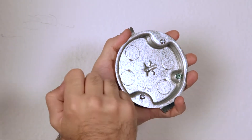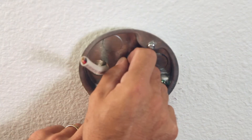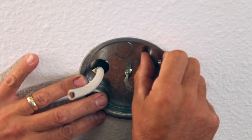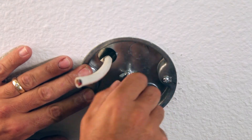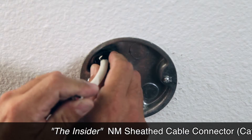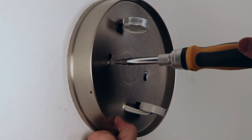I simply loosen the wing nut, leaving the protective sleeve covering the threads, feed the wiring and fitting into the box through one of the half-inch knockout openings, and slide the box in place so the bracket grips the drywall as you tighten the wing nut. Rotate the pan box to the preferred orientation. Finish tightening the wing nut, and if necessary, push the protective sleeve back down to cover the threads. I'm using Rayco's Insider, so I can install my cable connector after the box is in place. And that's all there is to it. The box is now ready to finish wiring and mounting the light fixture.